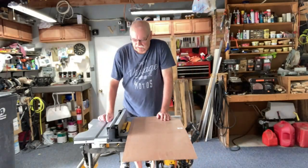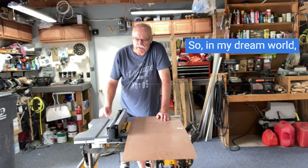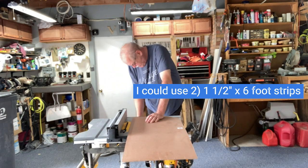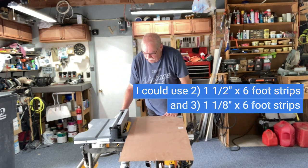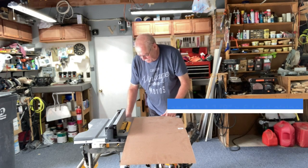So the outside rails are gonna be about 3/4 inch high plus 3/4 inch of the board, and then I'm gonna tack it into the side of the board. So I gotta set this at probably 1.5 inches. So 0 is right up against the blade. So that's gonna be 1.5 inches.